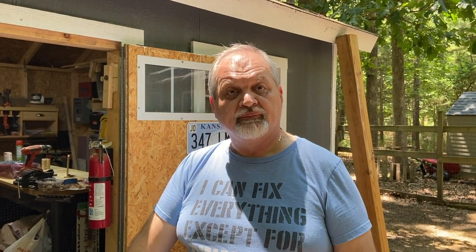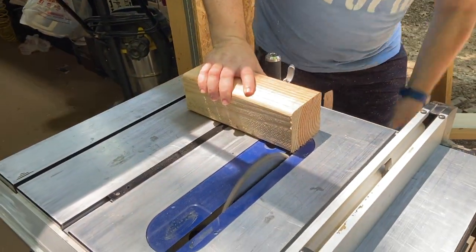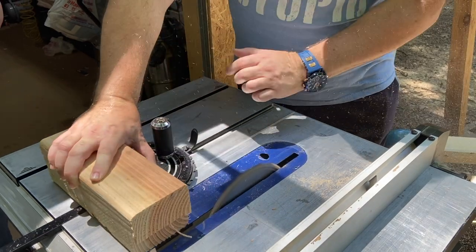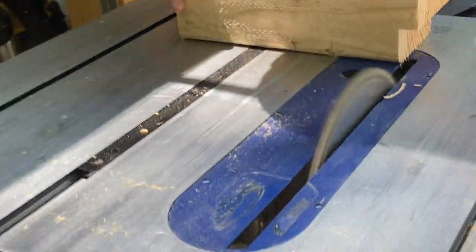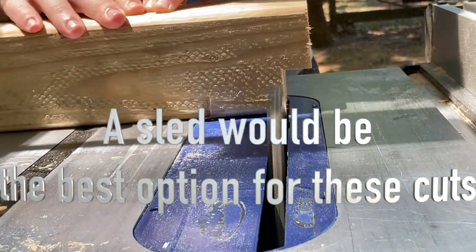We're going to leave the legs in a 4x4 configuration, but you can add a nicer detail if you like this style. You can do cuts with a power tool, or even with a hand saw with multiple cuts and then knock it off — we've shown that in previous episodes. We are going to use a dado because we have one and it's faster, but definitely you don't need it. Even with the dado we have to do multiple passes. We've set our fence to five and a half inches, which is the width of the board we're using as a sideboard.